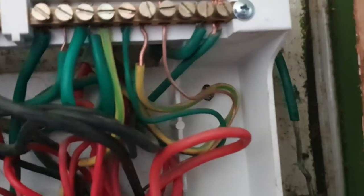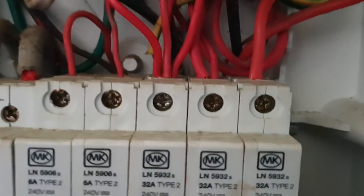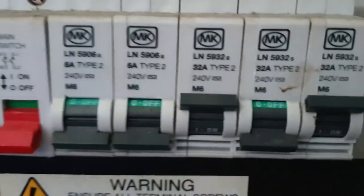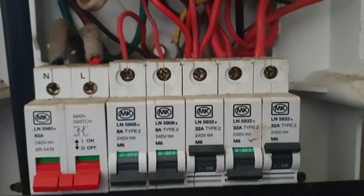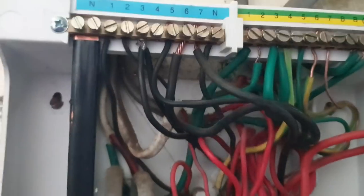So here's the consumer unit, in case you was interested in what the inside looked like. Very nice. Now, look, is that the shower circuit I was talking about? I can only imagine that's like a 6mm cable in there. It's got a 2.5 dogged in next to it on a 32. So I suppose if that was to supply a socket, you could almost say it's a spur, but it's still not very good, is it? Yep, that's all going in the bin.